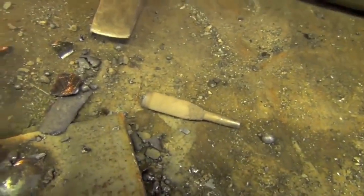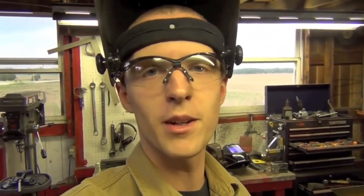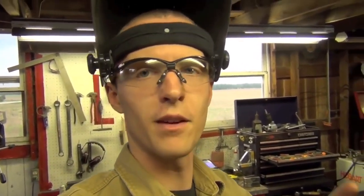Well, YouTube, that was an adventure. And what have we learned from all this, you ask? Well, 7024, the 2 indicates that it's not an all-position electrode. It can only be used in the flat position for horizontal fillets. And the reason for that is because it has a very liquid puddle and a very heavy liquid slag coating, as I'm sure y'all saw. And if you were going to try to do that vertical or overhead or something, it would all just fall back out. So it obviously doesn't work well someplace where you have to compete with gravity.